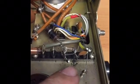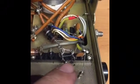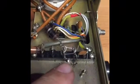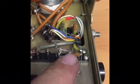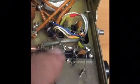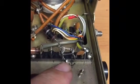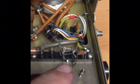You can see this capacitor has basically fried — there's a little bit of barbecue debris on the chassis. The diode I've already removed and I've got a little germanium diode laying in place that I'm going to solder back in. Once I get this repair done, we should get power output back on the meter and closer to 100 watts output, if the tubes are still good.